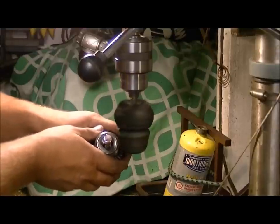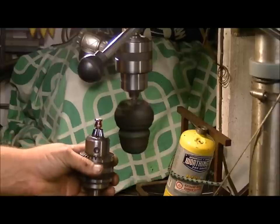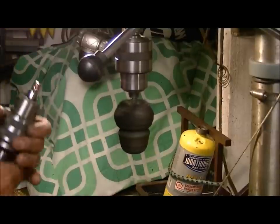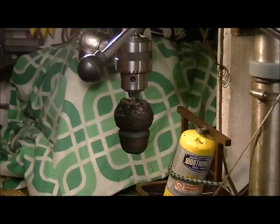These will get cleaned up later with soap and hot water, but I'd call that done — it looks really, really nice. That concludes our video of how to turn copper on a lathe and how to get your best results with it. Cutting fluid is important if you want a nice good finish every time — you don't need much, just a drop here and there. Same thing when you're drilling: use cutting fluid, and about 540 RPM is more than adequate. Polishing takes no time at all, especially if you've pre-sanded and taken some Scotch-Brite after the sandpaper — it makes the polishing go that much quicker, so you spend a lot less time polishing.